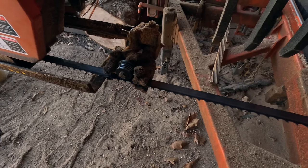If your blade guide arm moves — the arm that's holding your blade guide rollers which is directing your band — you will not cut flat wood. I can't tell you how many times somebody's called me and said their mill's not cutting straight, and I say, 'Loosen your band, grab your blade guide arm, and start wrenching on it.' And then they call me back later and go, 'Man, that thing moved like an eighth of an inch, is that bad?' No, it's not bad at all — it's horrible.